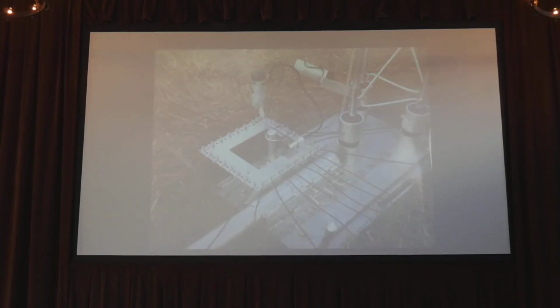This is the base of the vertical, and what you can see here is the falling derrick. It takes a 40-foot lever arm made out of 3-inch tubing. And notice the pull pins. When we assembled this in northeast Ohio for a test, we all wore mittens. You see the base insulators? This is the matching network that it takes to match it to 50 ohms. Here's the radial plate. We've cut radials for them. And this went so smooth and so easy, we said, let's build them another one. So they have 2 helicopters, and they now have 2 of these 160-meter verticals.